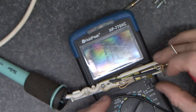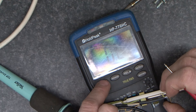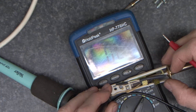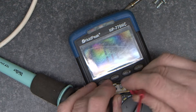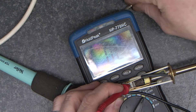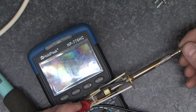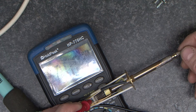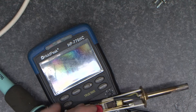Let's start off by testing the switch. I'm going to put my meter on to beep test and put it across the two terminals that do the switch. When I put the tip back in it will beep, and that confirms that the switch is working.